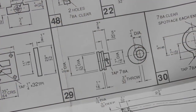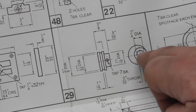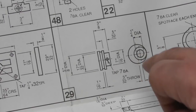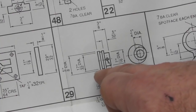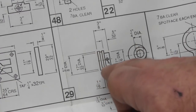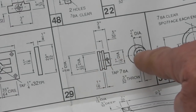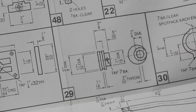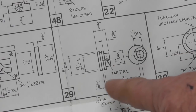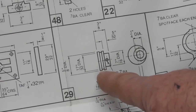So this part here, as you can see, is a circular part so it's going to be done in the lathe. It's got an offset boss on one side with a quarter reamed hole for the crankshaft to go through, and it's got an undercut in the center — I think that's probably oil relief or something like that. The eccentric strap runs around the outside of it, so as it rotates about this point the lobe goes up and down, making the eccentric push and pull which moves the valve in the cylinder. All measurements are imperial sizes.